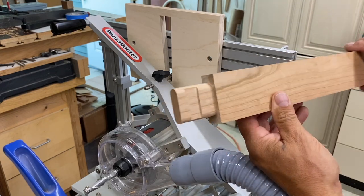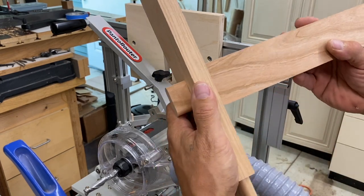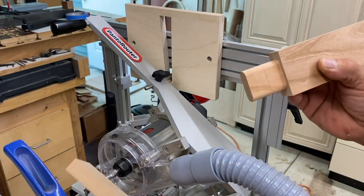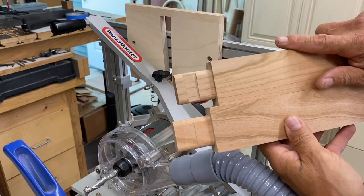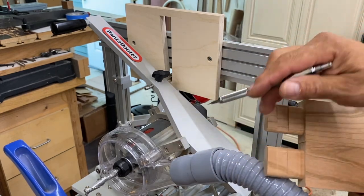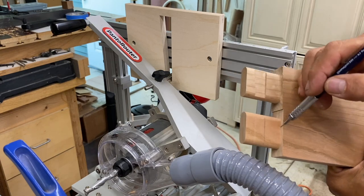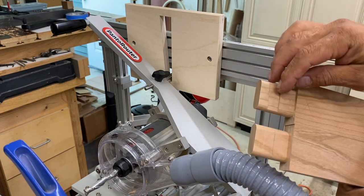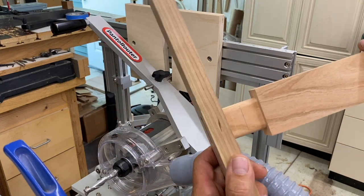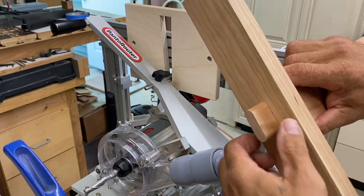So to make this tapered cut — kind of a tapered dado — I know that when the tenon is inserted and I mark a line right there, that's to the straight part of that dado. So I need to move the template that I previously set up one inch, because this needs room to tighten. When this gets inserted, I don't want that cut flush with this surface. I want it slightly back so that the tusk tenon can tighten everything up.